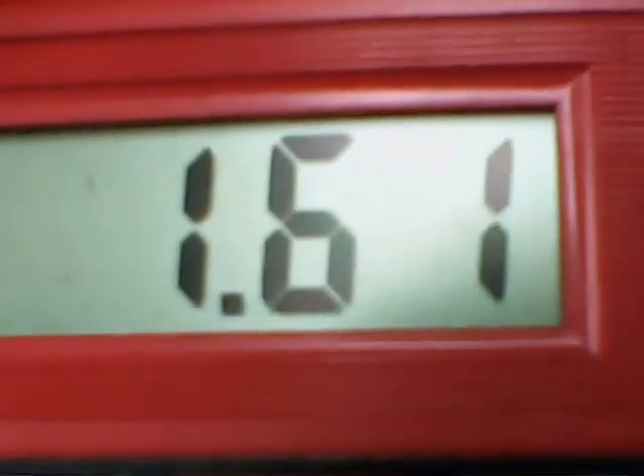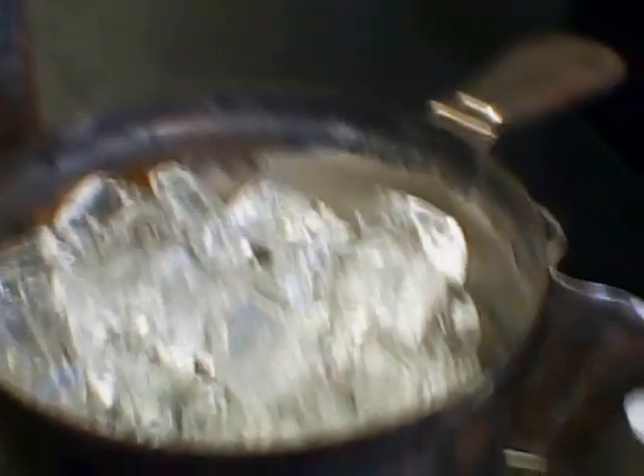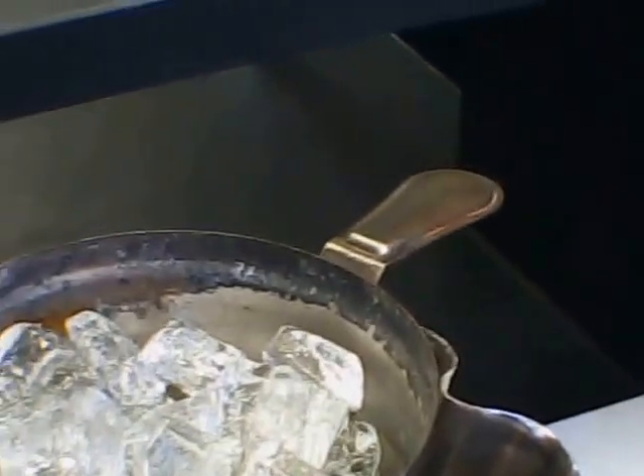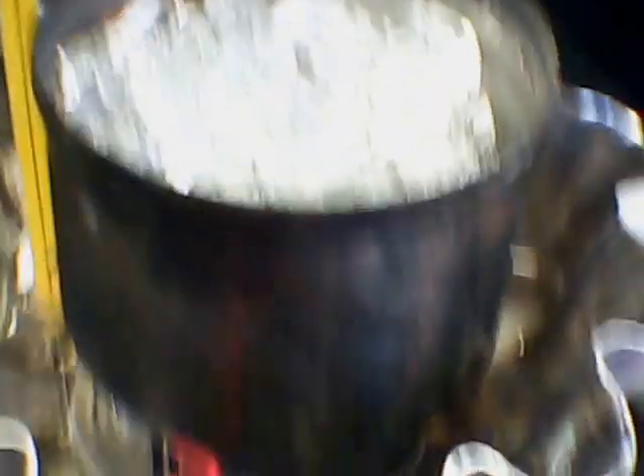At 140 to 142 degrees we're at 1.61 volts, and at 145 degrees we're safely within the safe operating range for the TEG. I would not heat it directly — even with the oil, I'd still put thermal grease on there to distribute heat. It's inexpensive. At 145 degrees we're at 1.62 volts.